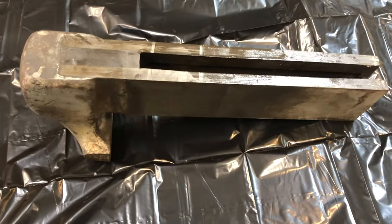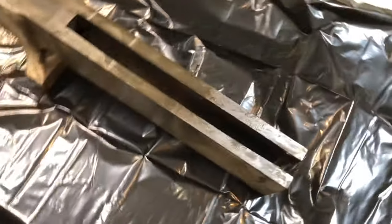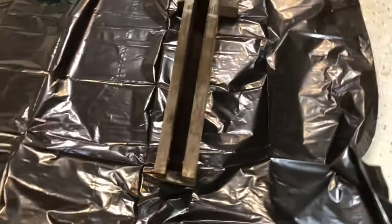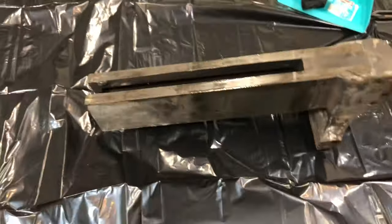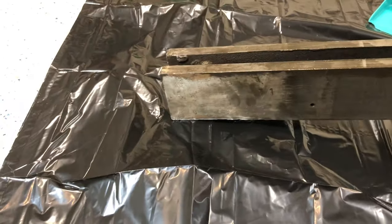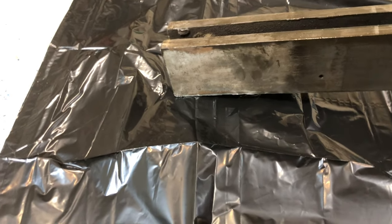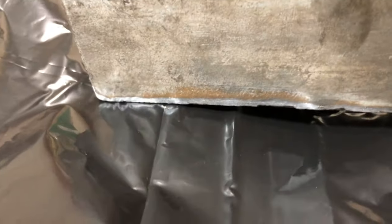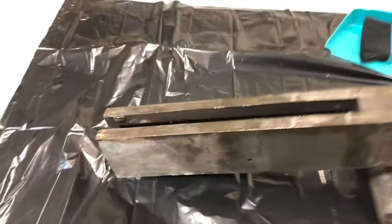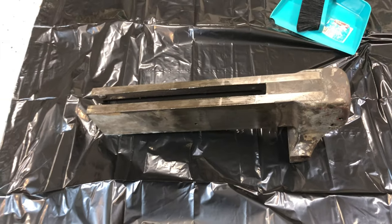Well, there's the ram out. The top of it had the corners rounded over just enough on the back that it would not come free. I suppose my grandpa probably used it to bend sheet metal, etc., get a square bend on something he needed, and just back here where the paint's still showing, that aluminum paint, there was just enough rounded over, it would not come out, and so I had to take the file and dress those corners up smooth, and she slid right on out. It is amazing the tolerances on these, the amount of detail that went into them.